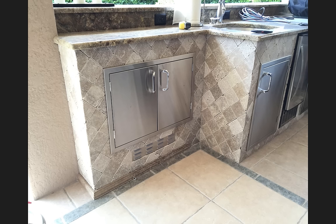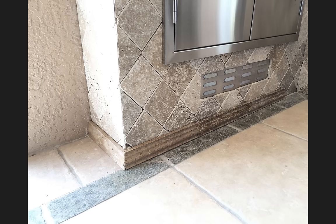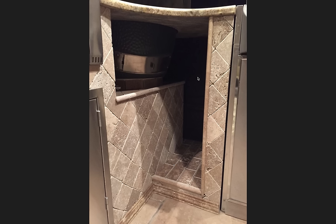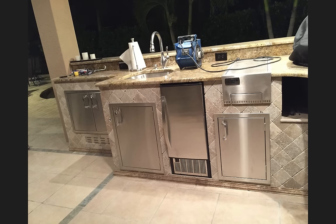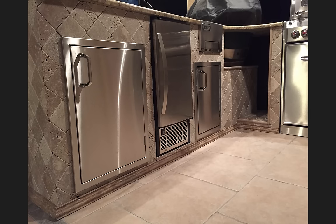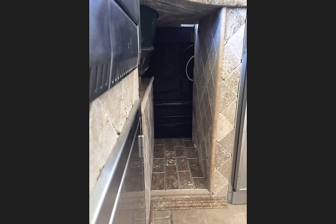Here I started on the bullnose. This is actually cut travertine shaped like a baseboard, and it just added a little extra something. I decided to go ahead and put it in — a 45-degree cut all of this. Each of these are about 12 inches long so I had to kind of hide all the seams. Here I used just a brick-lay pattern for the bottom of that area. You can see how painting this black was really smart — it just kind of disappears. I started to put an edge around all of the corners. Any corner that would really be touched, I put an edge. Here's the base installed, and this is pretty much finished. I went over this with a couple more coats of flat black just to cause it to disappear.